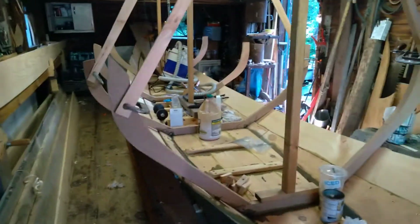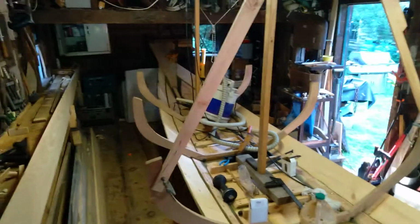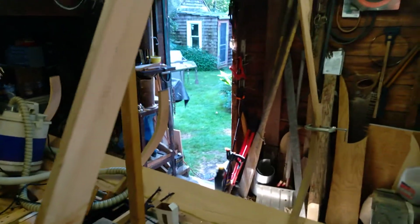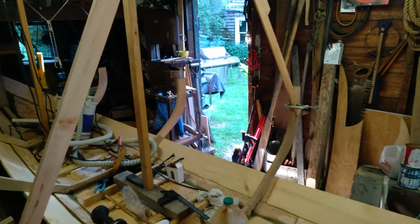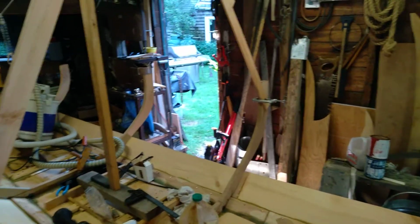They're kind of cutting planks into shape in order to either fit more planks in or to take up more space on the boat. So maybe they're tapering their planks at the bow and leaving them wider in the middle. So that's why they're cutting their shape. They're not cutting the shape typically so that the plank will lay in a certain way on the boat. Now that's what we're doing here. We're cutting the shape so that it'll lay in a certain way on the boat.